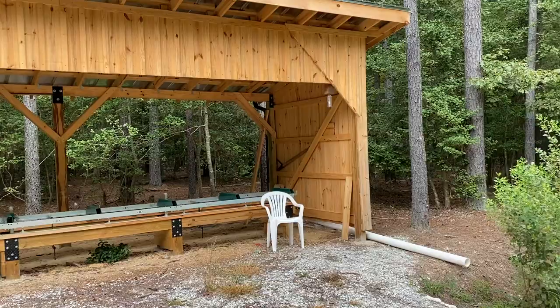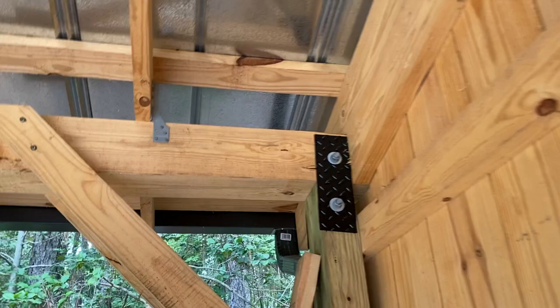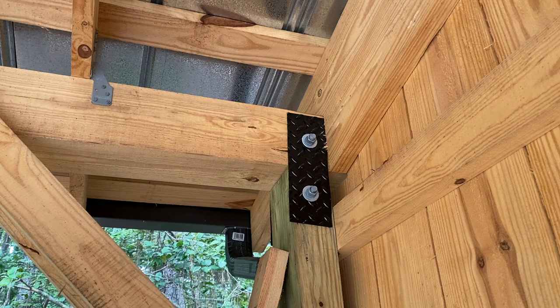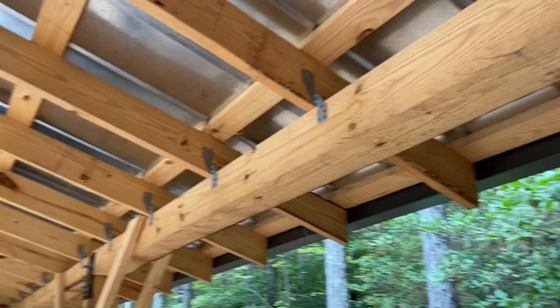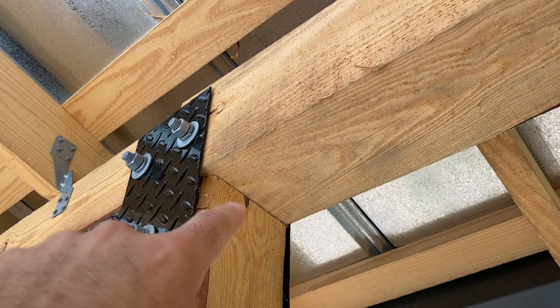When you're building with green lumber you do have to be concerned with shrinkage, splitting, and other effects as that lumber seasons and dries. I want to start by talking about the framing lumber. Generally when you're framing with green lumber, you don't have to worry too much about anything that's about an inch and a half or thicker — it's generally not going to split on you. The one thing you do have to worry about is when you have connections where beams meet posts; you want to accommodate some settling so that as that beam shrinks you don't develop a huge gap between the beam and the posts.